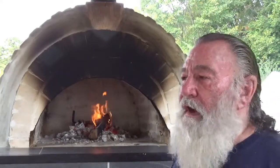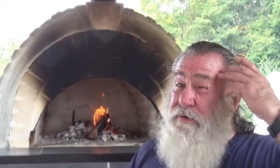Don't care. All right. So, we hit temps up to 900 today, and 800 on the floor. Still no cracks other than up there, and in fact that thing had flames coming up the chimney, so my fault. Okay, don't walk away from your fire. Dedicate yourself to burn in, and don't rush it. And I really wasn't rushing it. I was just trying to keep it simple to where I could put a big enough piece of wood on there and get some work done somewhere else, and then come back and adjust it and check on it. Nah, don't do that. Don't do that, novice.